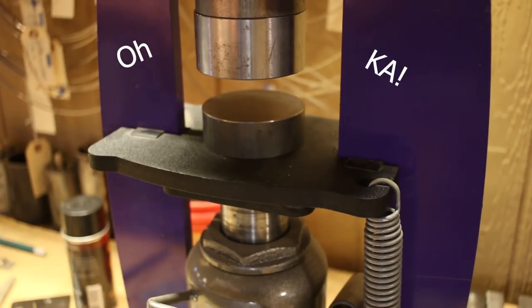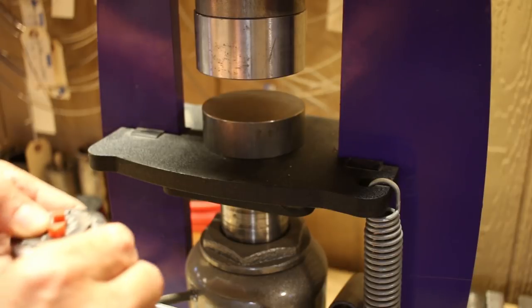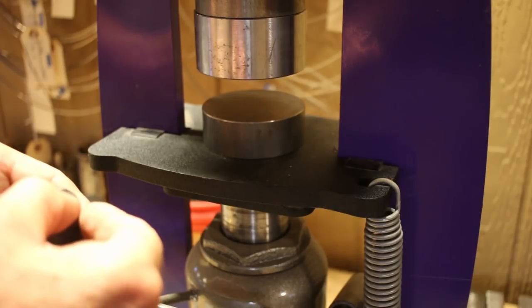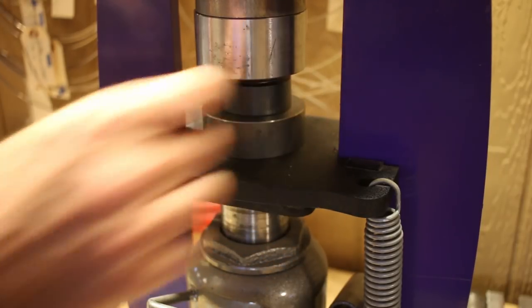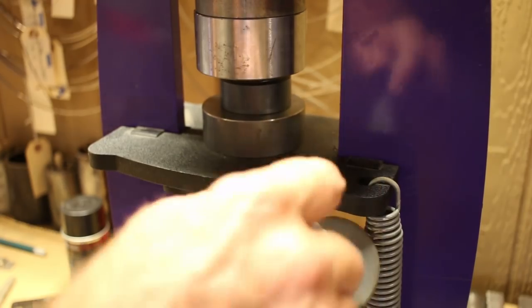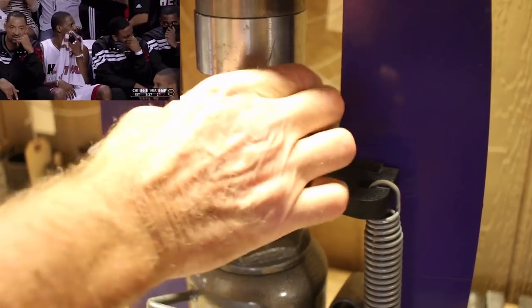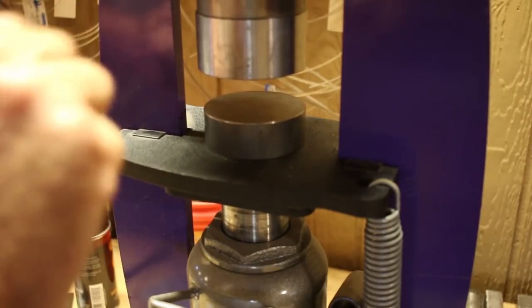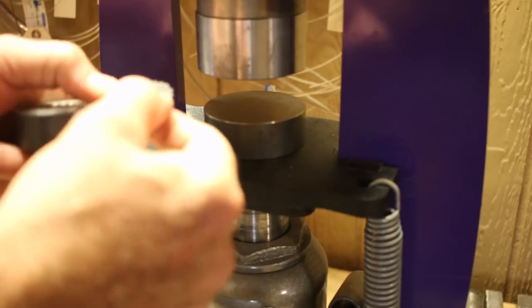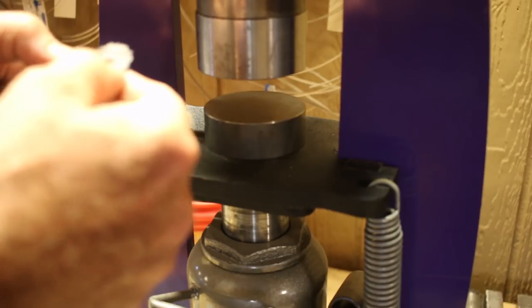Okay, I have annealed, and I'm just placing a couple of small pieces of urethane onto the concho to get my final impression here. I had just a couple of spots that weren't quite crisp enough. Let's have a look. Okay, that's a good crisp impression all the way around. I like that. So let's move on to the next step.